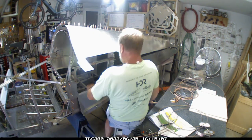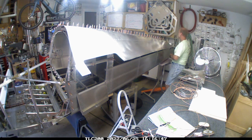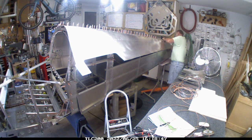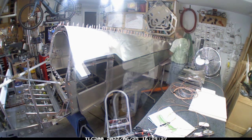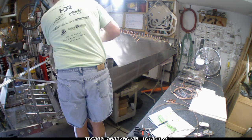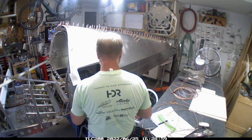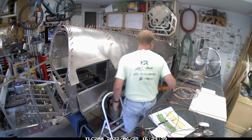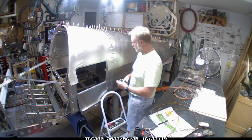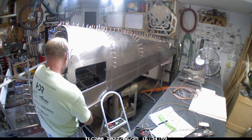So this is the other side of the rear skin that I was attaching, and I've still got a zip tie that I need to tie down inside. But I wanted to work on the GPS and the XM antenna location, as well as get the COM1 antenna moving along, and I couldn't do that without this skin in place. So I went ahead and installed it and got it all situated so it's ready to go. I will have to remove it briefly so that I can cinch down the zip tie that's inside.